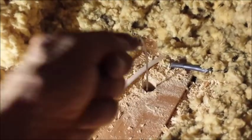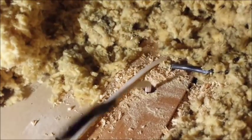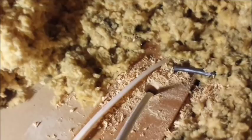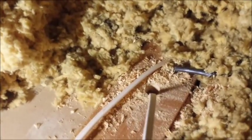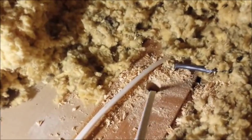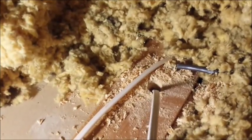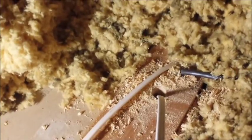Here's our fish tape. I'm going to pull that up. There's our wire. Now we're going to pull enough slack through in this case to run all the way over to the ceiling box for the fan. You determine how much slack you think you need, but I'm going to pull about what I think I need and stop about there. We're going to take it over to the ceiling box next.